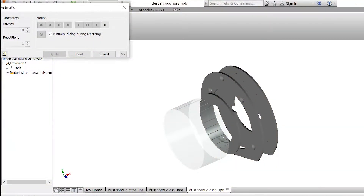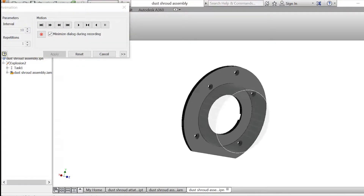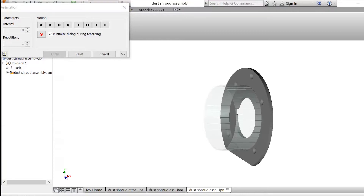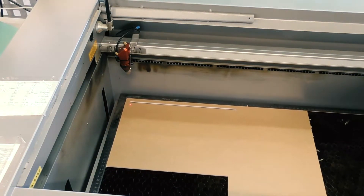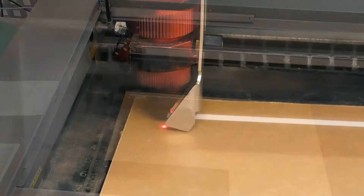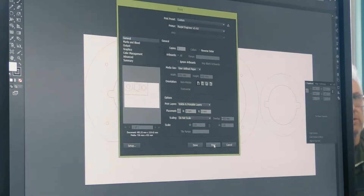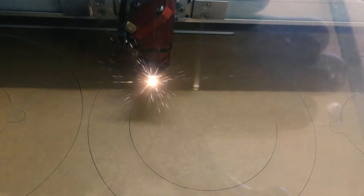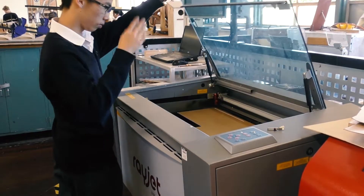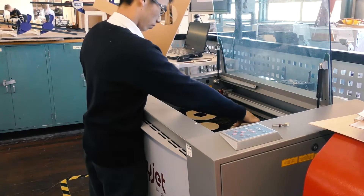After some working CAD I designed a new dust shroud — basically a new router plate with a narrow circular slot cut in the center to accept the plastic shroud. The diameter of the circular slot is big enough so that the plastic bristles can't touch the router bit even when bent over. I chose acrylic because I wanted to test new materials and also because the laser cutter produces much higher quality results with this material. Setting up the laser cutter to the correct height is done by moving the workpiece to the nozzle until the metal piece on the right displays movement. The main problem was that the laser cutter software couldn't pick up any circles in my drawing, so since the router plate consists largely of circles I had to draw everything by hand in Illustrator — which really sucked. But the cutting process took no time at all — 3 minutes max.